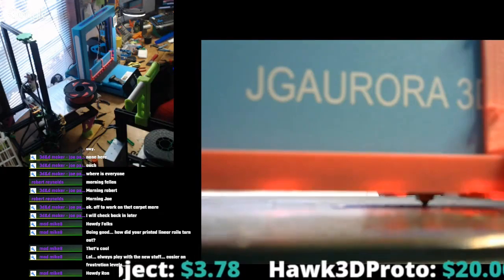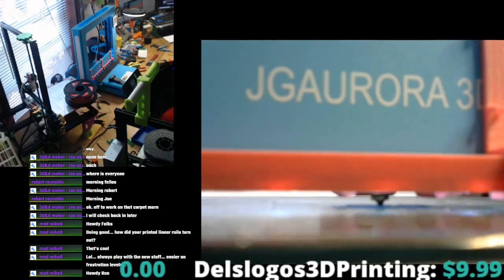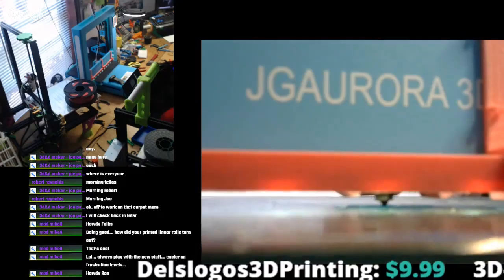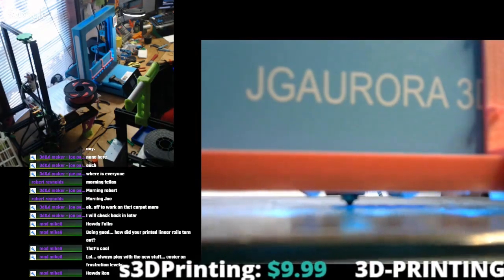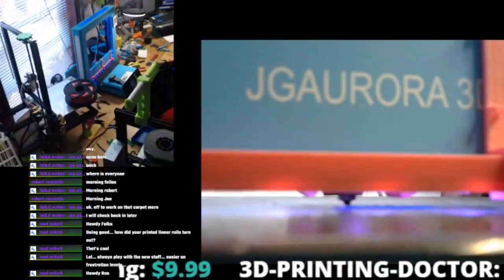Have you tried just printing a Benchy to see if it's just... Well, I took it apart. Well, that was your first mistake, but go on. No, I could hear it skipping. I know, I'm just being a jackass. But I wanted to look at the extruder anyway, so I took the extruder apart, and there's no adjustments in there that you can do whatsoever.